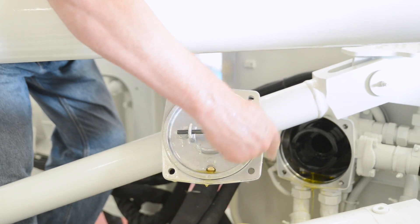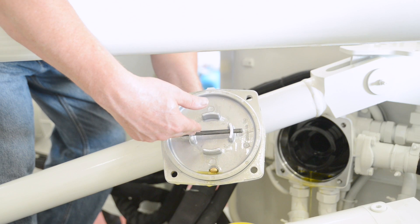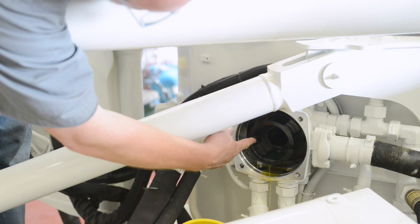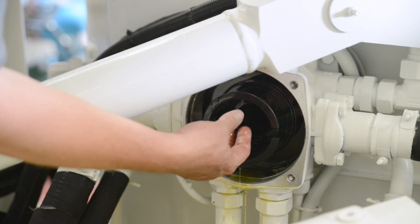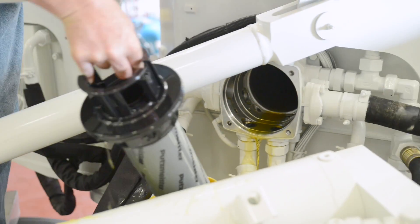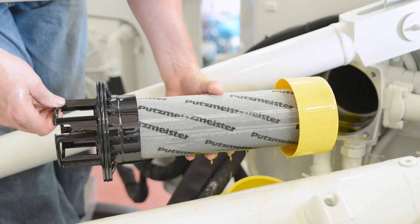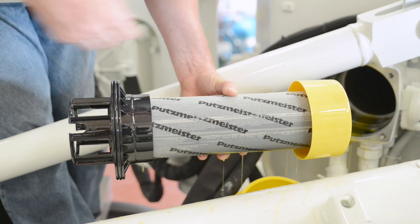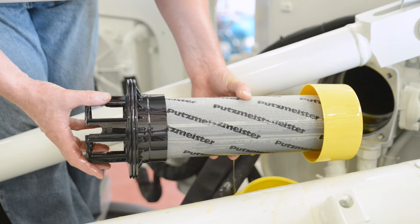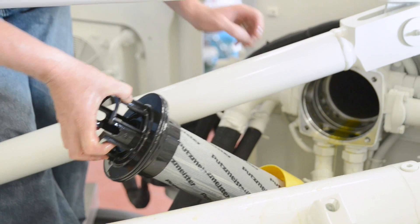On the cover there is an O-ring for a seal and a bar that we align our filter with. At this point we set this aside. The filter is inside here. I reach in, grab the filter, pull it towards me, and let the filter drain into the bucket. The only part that will be reused is the cap on the end — it's a cam lock. Just put it on the new filter and you're ready to reinstall.